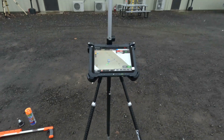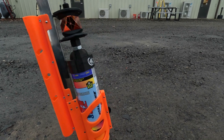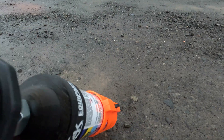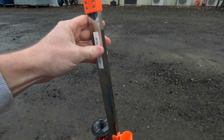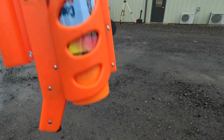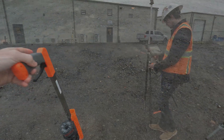I have a setup over here and I'll show some videos of it in use. Here I've got it all assembled together — we've got the prism on top and my total station over there is still following this prism. The holder that goes on top of the can is super tight; I can't even make it budge with one hand. Printed on the side is the rod height, measured out to be around 13 inches from the actual bottom point — the part with the dirt on it — so it can include height on your job files as well.